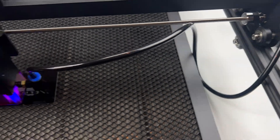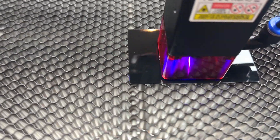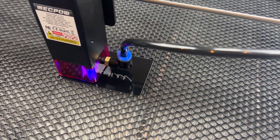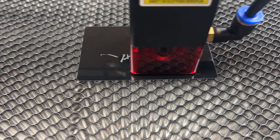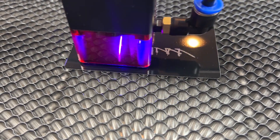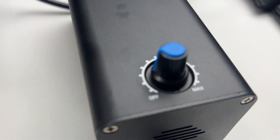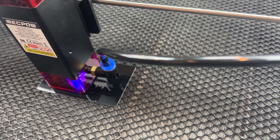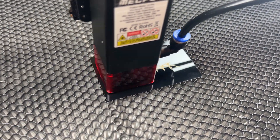Now with this last piece, I did hook up the air assist. As you can see, it kind of connects via tube to the laser head. And I had actually purchased some business-card-size aluminum engraving blanks from Amazon. Then here I was using a Cybertruck logo — kind of like a script writing from Tesla Cybertruck — and I thought that would be cool to try to etch onto the metal cards. As you can see, it's doing a pretty good job on this black metal. You can either use the air assist or not. I didn't find that it made any difference when doing this particularly, but you can crank it up and the air basically gets pushed through the tube into the head. The whole point is that it's supposed to blow any debris kicked up by the laser and keep that surface clean. And it really depends on what you're etching or cutting whether or not that's going to be useful.